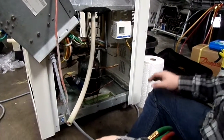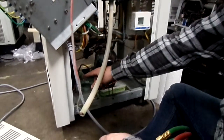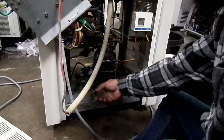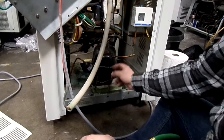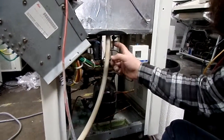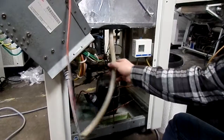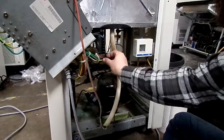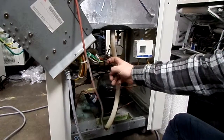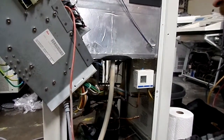The way the system works is you've got your compressor, goes through the check valve, through the coil, through your filter dryer, and into two capillary tubes. One is for the cold shelf, and the other is for the coil. You know which is which on this one because it has a fat defrost line along with our skinny cap tube going into the coil that goes on the top, so it can defrost it when necessary.